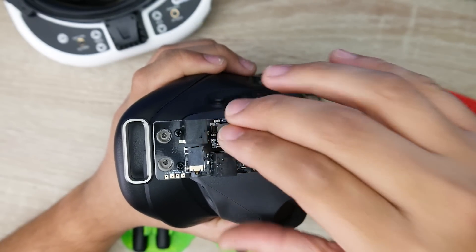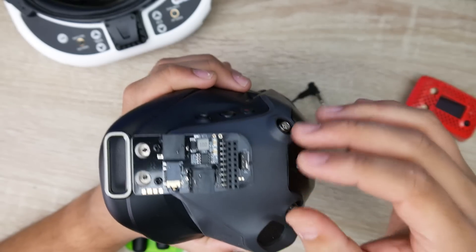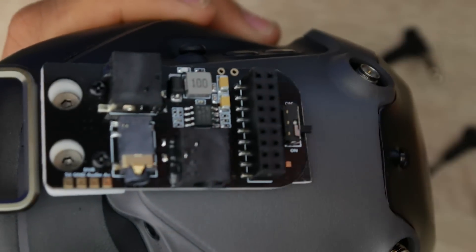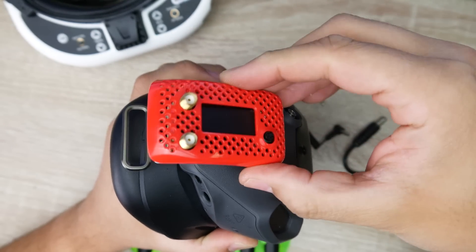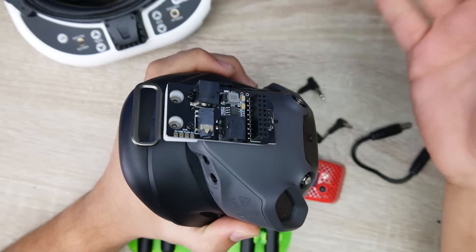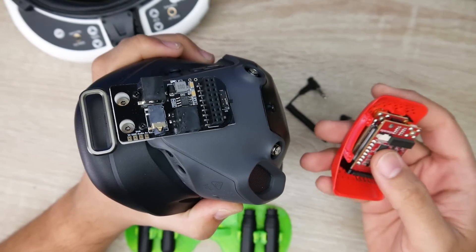There's a voltage regulator that steps down the voltage to 5 volts for the module itself, then pipes the rest of the voltage down to your goggles, while also incorporating a power button. For 12 bucks, you can't really complain. Another really nice design detail is the double line of pin headers — using a double row gives it way more rigidity than a single line. They also provide double-sided tape so you can cover the exposed pads on the bottom and avoid accidentally causing a short circuit, because the modules are pretty expensive and you really don't want to damage them.